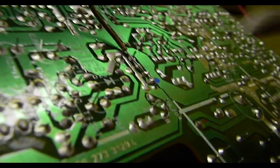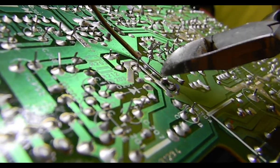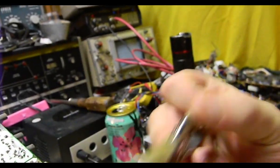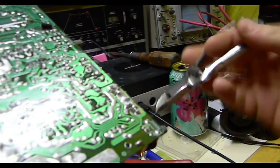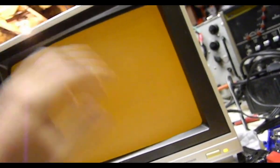Don't reflow or it's going to be dead — you've got to tack all this stuff on by hand and inspect it yourself the old-fashioned way, or you're going to lose a monitor. Don't be me. Got a little bit of solid core wire — not even copper, but the solder still sticks to it. We've got a bridged connection where the PCB lifted up for the audio terminal. Using our ghetto flush cutters — which are actually fingernail clippers. You can get these at a pharmacy. They work great as flush cutters and I've been using them for more than 10 years. Oh, I feel so fucking foolish — I did all that, I feel so amateur now. It works now!